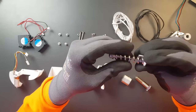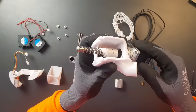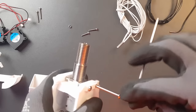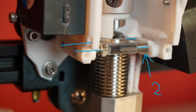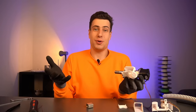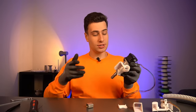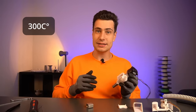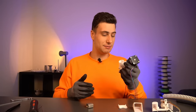The 3D printed PLA housing holds everything in place. The pellet screw gets attached to the stepper motor with a coupler and then screwed to the housing with four screws. The extruder barrel is directly connected to the housing with two screws. PLA directly connected to the hotend — how is that supposed to end well? Well, it does because of applied physics, but only until you exceed 300 degrees Celsius. From that point I recommend printing all parts in a more heat-resistant plastic.